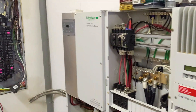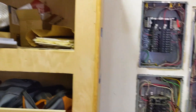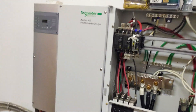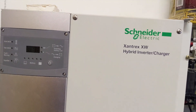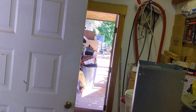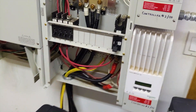We're working on an upgrade to a system — I might have a video of this from 8-10 years ago when it was put in. We're upgrading to a SolarK, as the XW doesn't have the capability of working behind the meter and selling everything to the house. We're putting in CTs, a SolarK 12K, Fortress batteries, getting rid of charge controllers, reworking the whole system, adding a 13-kilowatt Cummins generator just outside this wall, doing some well work, replacing pumps, adding generators, upgrading solar — just giving this thing a complete makeover. Right now I'm decommissioning and tearing it down.